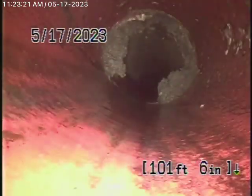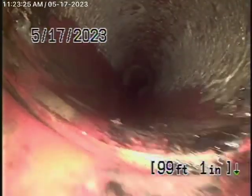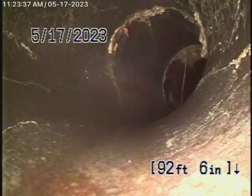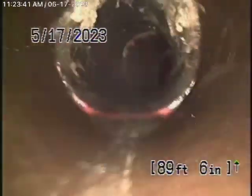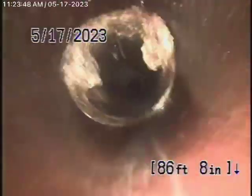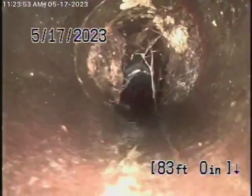You can see minor little roots coming through the coupling over there — nothing serious, nothing that's going to cause a blockage at this time. Clay pipe is really susceptible to little roots getting into it. It comes onto the property and changes to a 4-inch clay pipe. You can see very minor little cracks in the line. What I look for are big problems like massive breaks, massive dislocations, heavy roots. What you're looking at here is very common in a clay pipe.